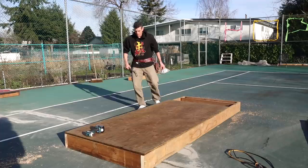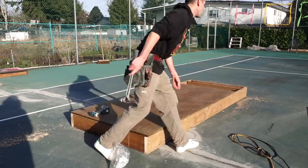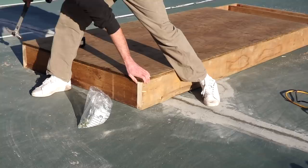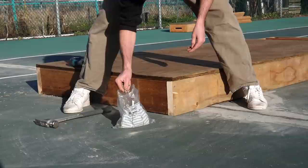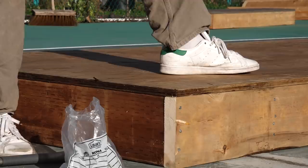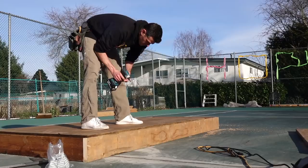The box could very well not be square, so we're going to start on one side and work off it, because the factory edge of the plywood is totally straight — I'm just going to get that perfectly lined up. Once I've got this corner and this edge totally square, that's when I'm going to start putting in screws. I've got two-and-a-half inch screws here, and all of this is treated. I'm going to follow along this whole edge and it looks pretty darn straight. Right now I'm just going every 16 where my joists are.